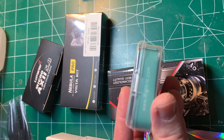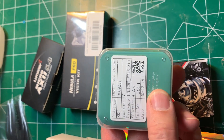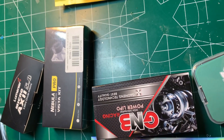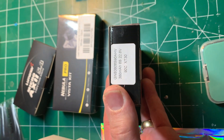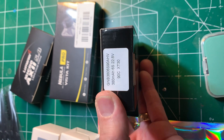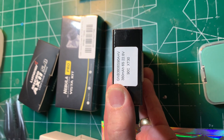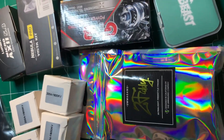The flight controller is the recommended iFlight Beast. This is an F7 all-in-one flight controller, 45 amp rated — it's a toothpick type controller, pretty interesting design to reduce the weight. Tommy had these batteries specifically designed by GNB: 380 milliamp hour 6S batteries. They're pretty unique and probably a little hard to find. I got them off the Umagod website. They're 90C rated with an XT30 connector.